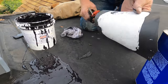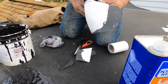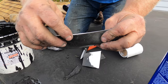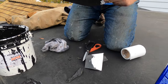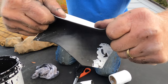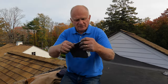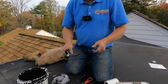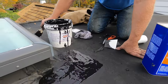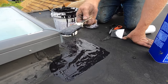And this is how well it works — let me show you. I did a sample here; let me cut this. There's a sample — see the EPDM black on the bottom and the white silicon. Look — it stretches! This is amazing, most amazing stuff. It stretches with the material; you cannot break it apart. And that's how it sticks to this EPDM — it's unbelievable. Get yourself some super silicon and you can fix your own roof.